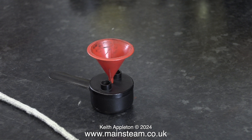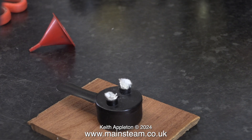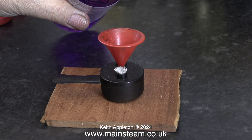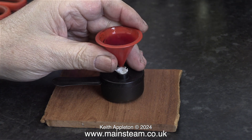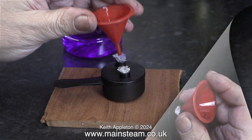What I'm going to do is replace the type of wick that is in these burners. I'm using a more modern type of wick material which has glass fibre cores — here you can see them. In this application the glass fibre doesn't burn. But you can't just stick a short piece of wick in the top — this is a bit deceiving. I loosely packed the entire tank with this wick material. If I was to pull the wick out you would see that each of the wicks is about four inches long, which is more than adequate to soak up the methylated spirit inside the tank.